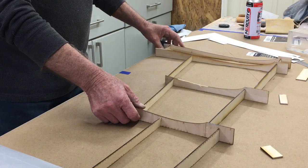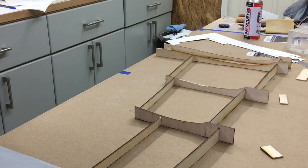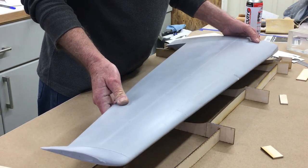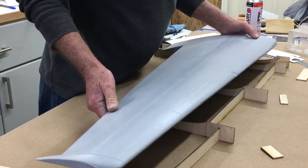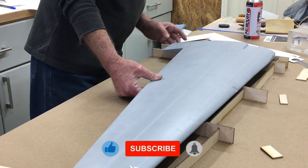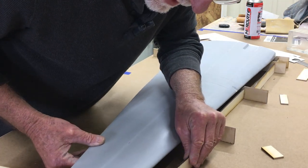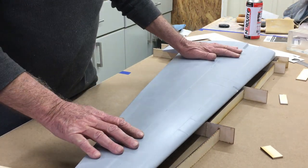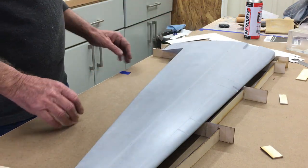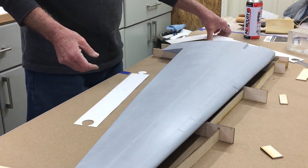Here's the right wing. I've made the framework for it. The wing is just gonna sit in this framework, which will hold it in place so that I can do the mold layout. You don't really need this done the way it is, but I wanted to make sure everything was nice and solid — no play. It's nice and flat on the bottom, and it allowed me to make the parting planes up.